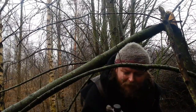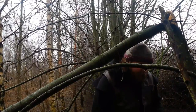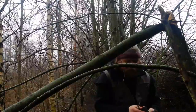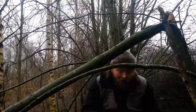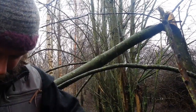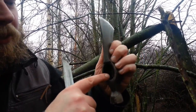I've had an axe in the drawer so it has shrunk a bit on the shaft. I'm going to address the transition between the top of the head and the shaft. I've gotten a small ridge here that I'm going to remove and better seat the head. I filed down the edge here to give it a smoother transition because on the original from factory it's a very sharp point.